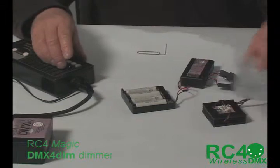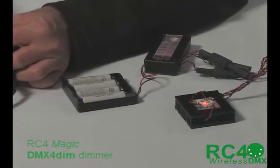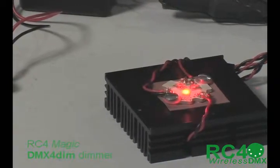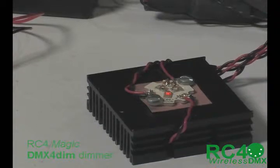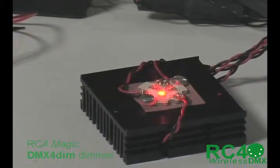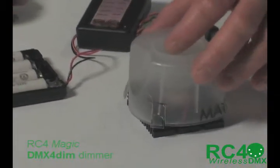Note also — I'm going to take that diffuser off again. I am very, very pleased with the quality of our LED dimming. You're probably familiar with LED dimming that looks very steppy down at the bottom end, and this is quite smooth. You will see a few increments there at the bottom, but this is LED dimming with 16,384 steps. That's 14-bit dimming. There certainly are some LED dimmers out there that are 16-bit — 65,000 steps — but there is some trade-off between microprocessor size and power, how many steps you can have, and how fast you can run the PWM cycle. This is a good trade-off for something that will fit into a very small package like our little dimmer, and still give you enough steps that the bottom end of the curve looks really very, very acceptable.